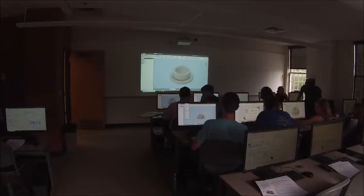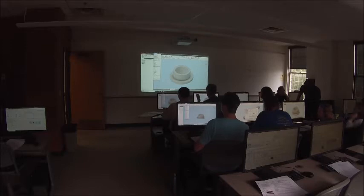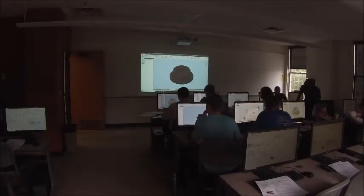All right, so next you're gonna set the material in the drop-down. I just usually set it to bronze cast. The oilite bearings are actually sintered. They're not actually cast, but it's the closest thing.